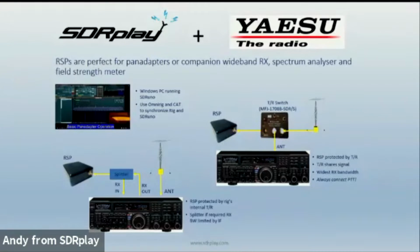Now, just talking a bit about how to use the RSP as a pan adapter. The only thing to really remember when using the RSP as a pan adapter is that it's obviously connected to your rig the whole time, and you just have to be careful that the input of the RSP is protected when you're transmitting, because I know some of you guys can generate quite a lot of power out of your transceivers. So we recommend you can burst up to 10 dBm, but constant power should be no more than 0 dBm into the receiver.